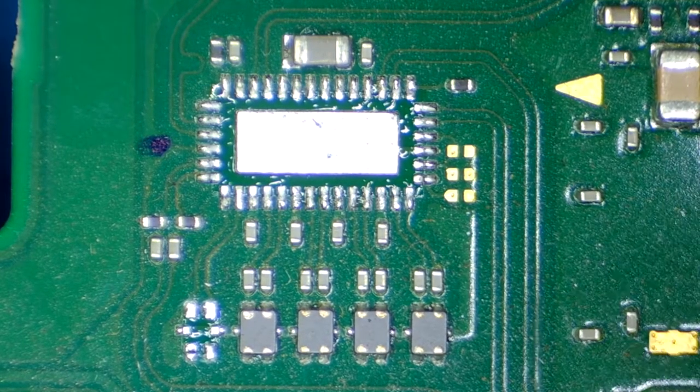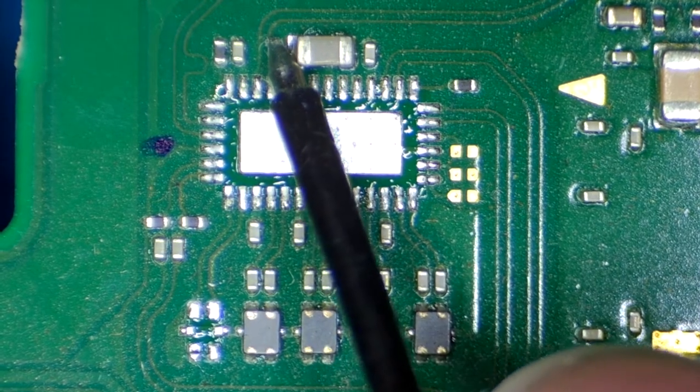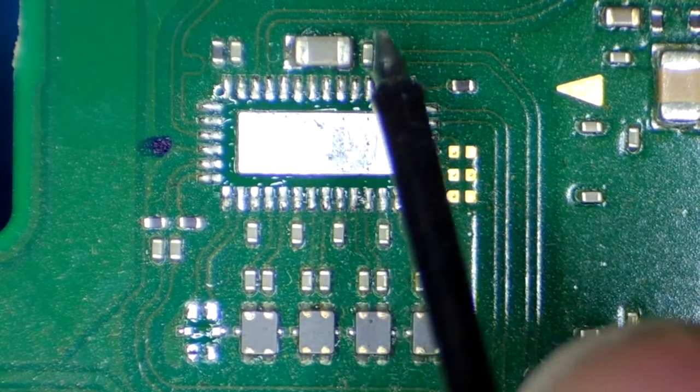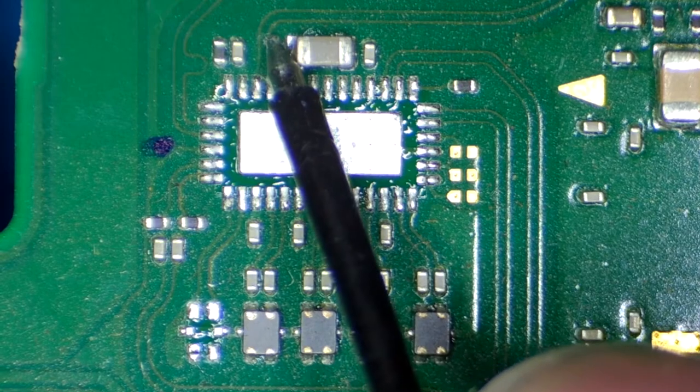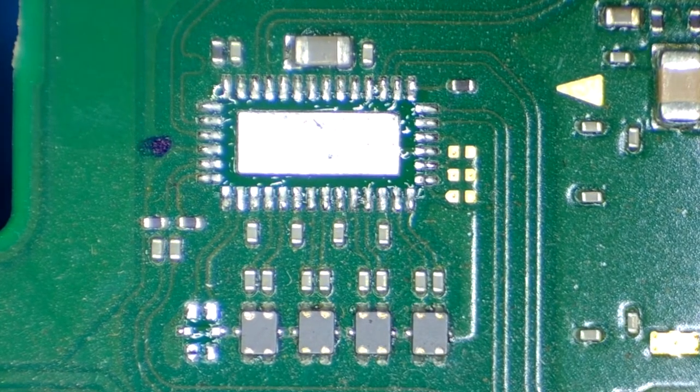Let's measure — and our short is gone. Great! Most probably our problem is only the P13 USB, because the short is gone. So now I will pull a filter from a donor board, grab a new P13 USB, install it, and hope for the best.